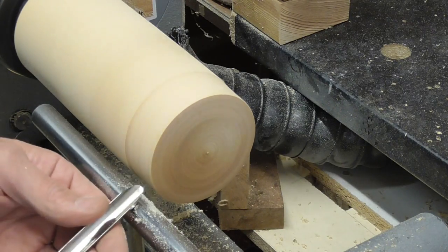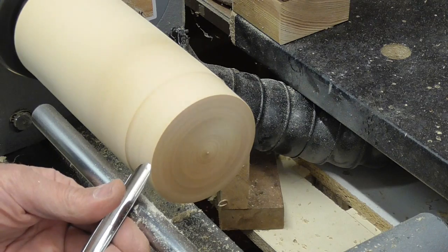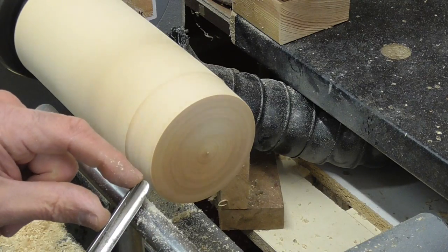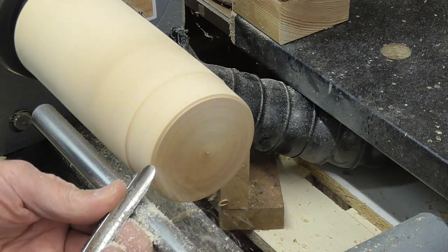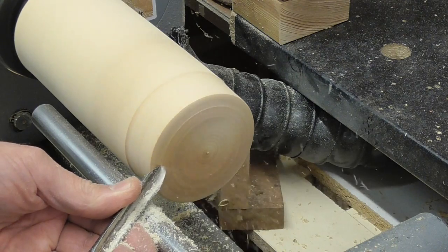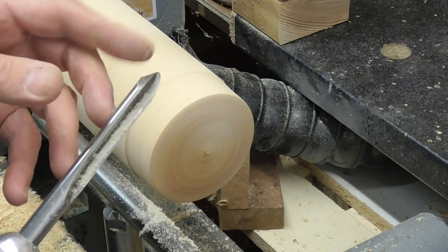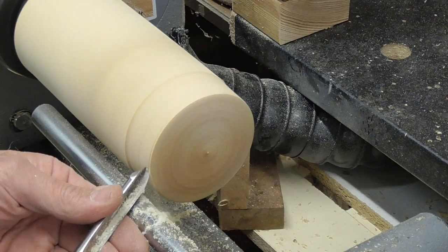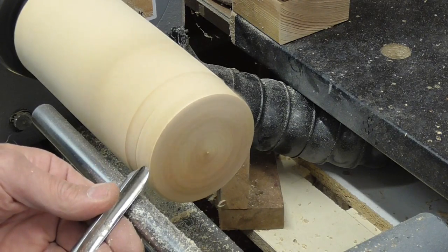The way you can also do it is with very, very light cuts. Ride the bevel on this side, bearing in mind you're going to be cutting on the left-hand side of the nose, but you can start the cut here to establish it and then ride that bevel and carry on with the cut. But if you keep your thumb here it's going to resist any tendency of the gouge to want to skate back, because as soon as you start to cut it's going to want to do that — because it's got nothing to actually support it.